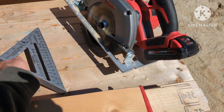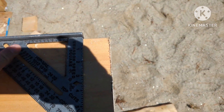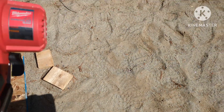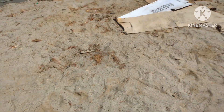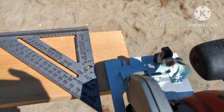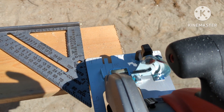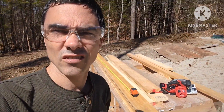Now one thing that's a little different than normal — normally you'd have like a chop saw, or miter saw, people call it. But I'm doing something a little different here, because I want to be able to use this battery-powered saw because it's quiet, and my chop saw works off that annoying generator which is super loud. So what I'm doing is basically using this as a guide — the framing square — to create something I can push the guard against and then do my cuts. That way I'm keeping everything nice and straight, doing it kind of on this table here, just free-handed.